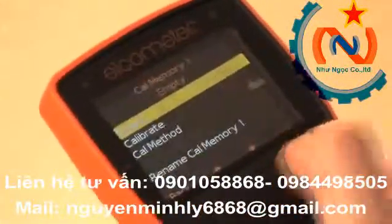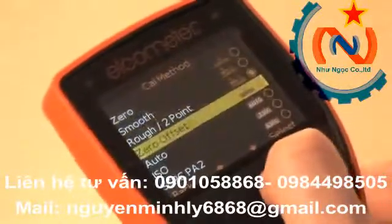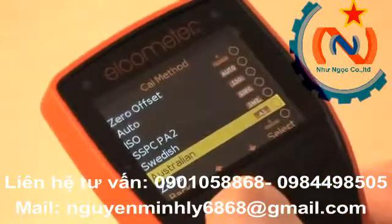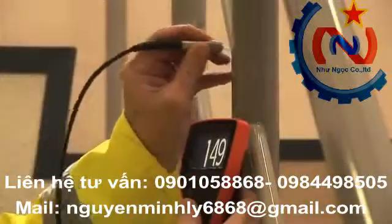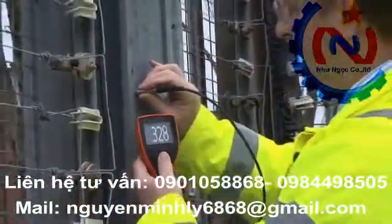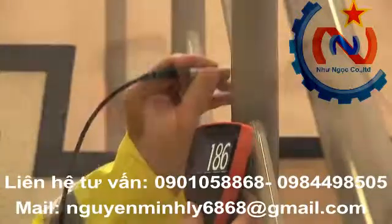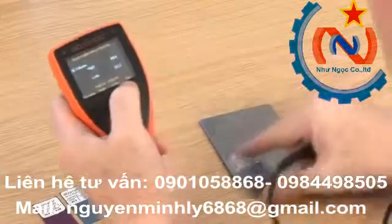Elcometer S and T models have 4 additional predefined calibration methods included for ISO, SSPC, PA2, Swedish, and Australian standards. These not only define the calibration method to be used, but also set up the data collection method as defined by the appropriate standard. For more information, a full instruction manual is available at www.elcometer.com.